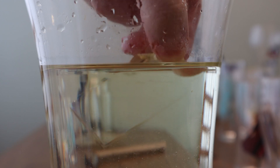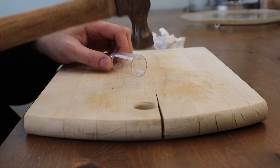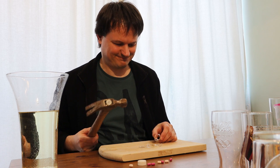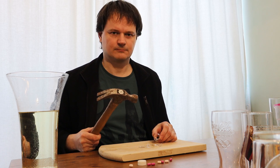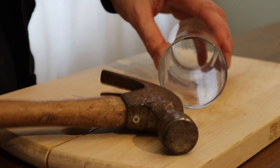There are only two problems with borosilicate glass. One is that it is very hard, so it's difficult to break. The other thing is that, unless it's very thin, you can't really melt it with an ordinary flame — meaning you'll need some high-end, pure oxygen-based flame for that. So if you don't have that, you can't use it, and your only option would be using ordinary glass, which is better than nothing.